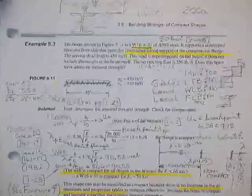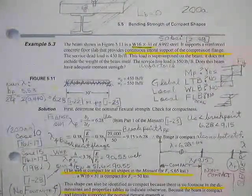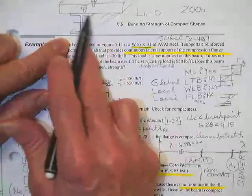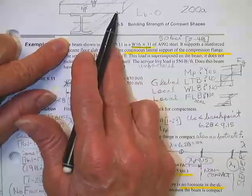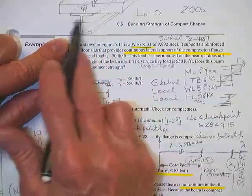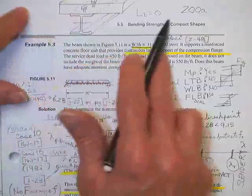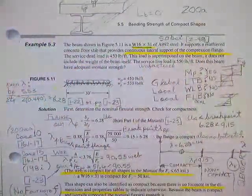All right. Here's one way you can stop your problem. I see you have a problem. Yeah, lateral torsional buckling. Here's how you can stop it. Just weld these little studs. They do it with a little gun, pop, pop, pop, pop, and then pour concrete on the top of it. And then the top flange, even though it is in hard, high compression, can't pop over to the side, because it would have to take the concrete slab with it, and all the other beams and the walls, and so it just can't buckle laterally.